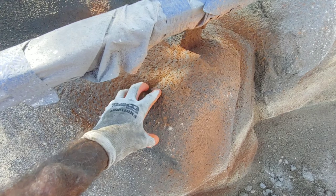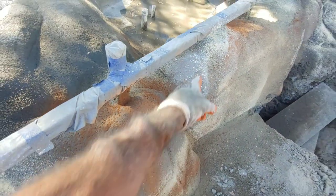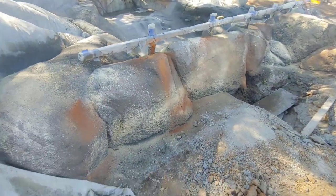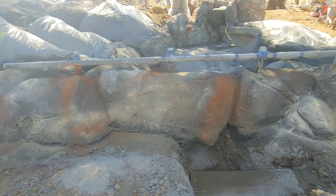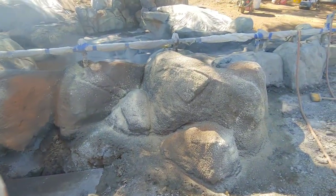It's starting to firm up, so I need to get my trowel on here to knock down the spit marks a little bit. That spot's getting gray — Daniel, we got to get a hose over here, wet this up. It's getting gray, dried out, powdered. Daniel, get this a little wet and then we'll be ready to trowel down.